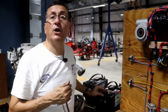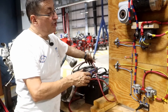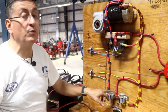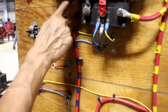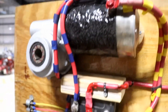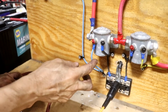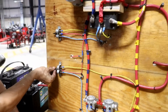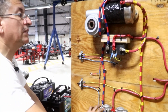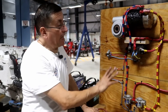What is the solution? I need to replace the solenoid control box, or replace it with a couple of automotive relays like this. I am going to connect these in parallel to demonstrate that with the relays it works. In the middle, between both relays, I receive the power from the battery. From one side of the relays I go into counter-clockwise rotation, from the other side into clockwise rotation. Each relay receives the signal from one side of the switch or foot pedal. With the relays the system is working; with the solenoid control box it was not.